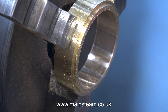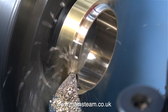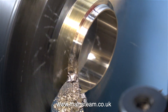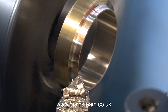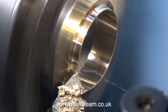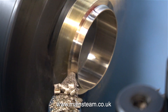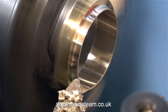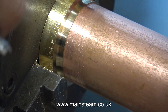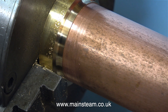Before I push the piece of copper tubing into the brass fitting, I need to start shaping the bottom part of it. To shape the underside of the chimney cap I'm using a round nose tool. This particular round nose tool is designed to cut from left to right, but I use it the other way around — I just angle the tool post, and it's better for the video because usually when I'm doing close-ups the tool post is often in the way. I think that's about right; I don't want the chimney cap to be too big. Now all I have to do is move the brass part to the back of the chuck and then press the tube into place using the tailstock — a very simple, quick and easy job.